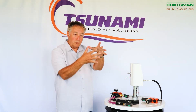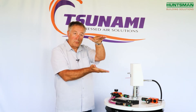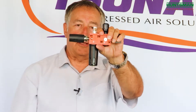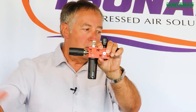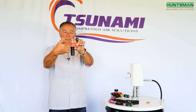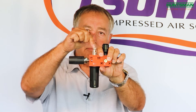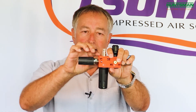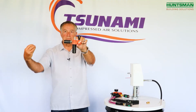It's an air motor, and there's a piston with O-rings that go up and down in here — it needs to have some type of lubrication. What you'll sometimes see is a lubricator put into a system. Inside the lubricator there's a little needle valve, and as air passes through, it drops a little drop of oil down into that airflow and atomizes it. As that air flows out, that atomized oil turns to a liquid droplet.